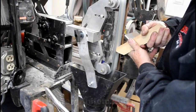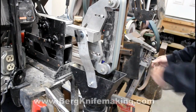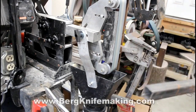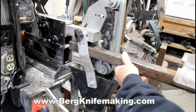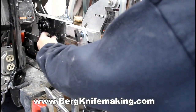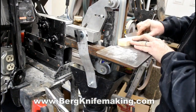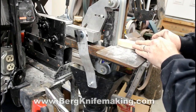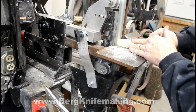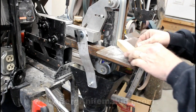Here's a different view — you can see the aluminum arm that attaches the dust hood to the 2x72, and you can see that you can move additional tooling arms in and out with ease. You can use this with the tilt table too. My particular grinder is an Origin Blade Maker 2x72, but I'm sure this can be configured to most 2x72 grinders, or a system like this could be configured to most grinders.